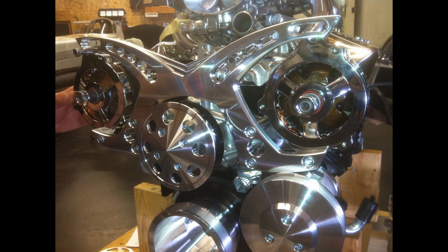Here's the engine after having been outfitted with a nice serpentine system. At the time I didn't have a CNC mill, so I couldn't make my own brackets. The serpentine brackets have to be fairly accurate in order for everything to function, so it's hard to use cutting and welding as the fabrication method, although it is possible. If I knew then what I know now, I would have tried something with cutting and welding — if the brackets were a little off after welding distortion, it might be possible to get them to work via cold setting. Still, it's better to machine it: it takes less time, it's more accurate, it's cleaner.